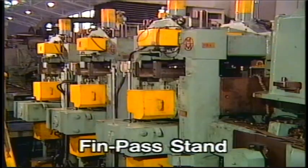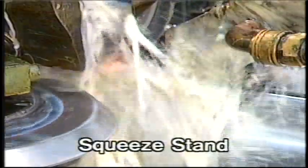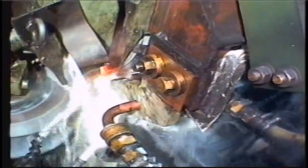The U-shaped strip is then formed into an O-shape through high oval calibred fin pass stands. For the fin pass stands, a four roll design is adopted to assure high quality forming that generates no roll scratches. The strip that has passed through the fin pass stands is then fed to the five roll design squeeze roll stand and shaped there accurately for welding. With the specially calibrated fin pass stands, the welding angle is set at a larger angle compared to that of conventional systems. As a result, higher stability is obtained at the welding points to assure high quality welds.